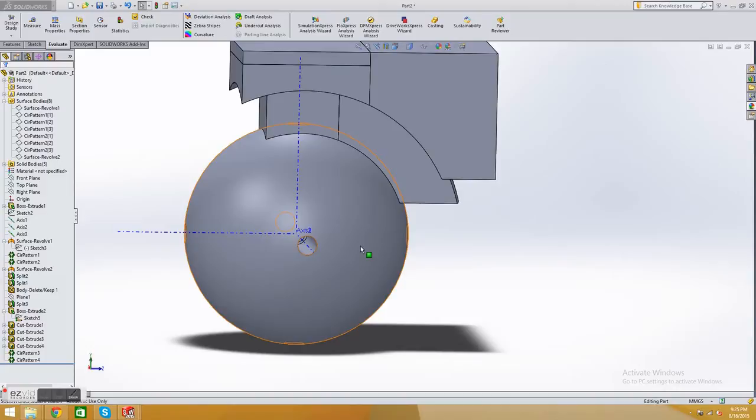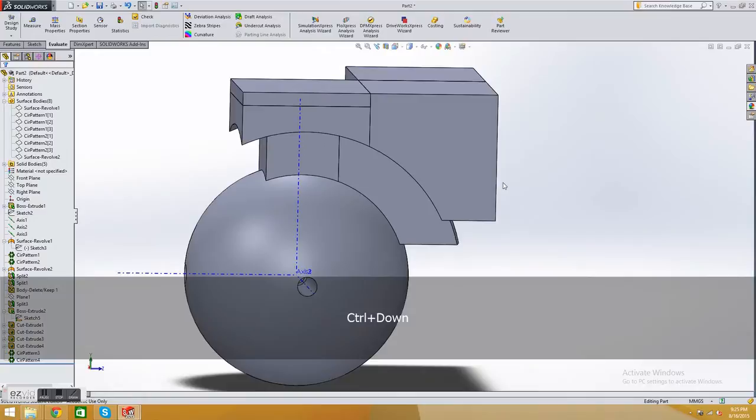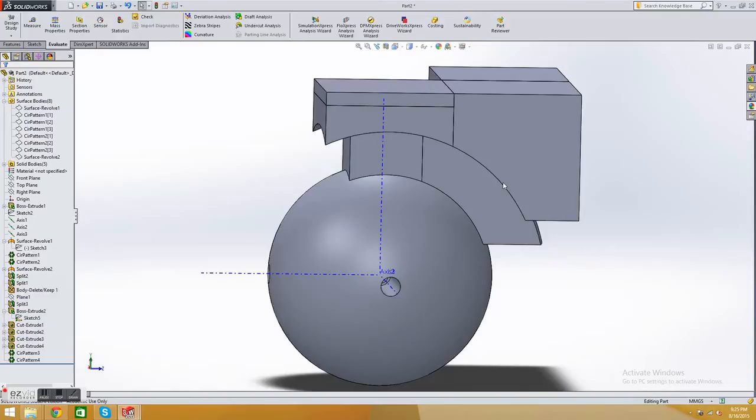This tutorial is going to show how to basically take the pieces from their basic shapes to something ready to be printed. So we're going to tolerance the pieces, we're going to add a little room between them so there's room for them to move around, we're going to fillet the pieces, we're going to round the edges for smooth turning, doesn't lock up, and we are going to hollow them. Use up less material, make 3D printing much cheaper.